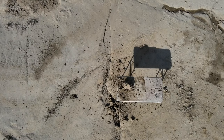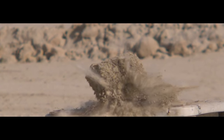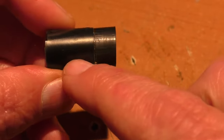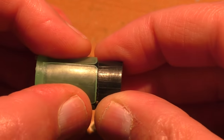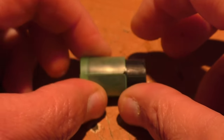The first two shots came apart again. The third shot didn't, but we had terrible stability — even using a fully rifled barrel we didn't get enough spin to cause that slug to fly through the air straight like a bullet. Fortunately, I anticipated this might be a problem. Because we didn't have a really tight fit through the barrel, we weren't really engaging the rifling, so I added some electrical tape — adding about ten-thousandths of an inch — making it a lot snugger. Hopefully this will solve the problem and give this thing sufficient spin for stabilization.